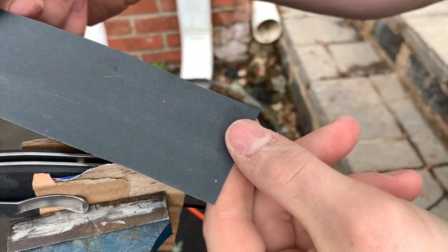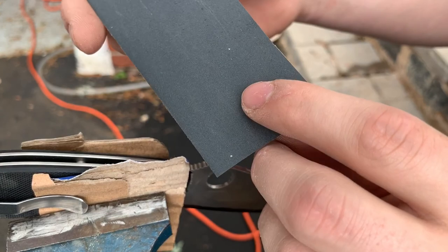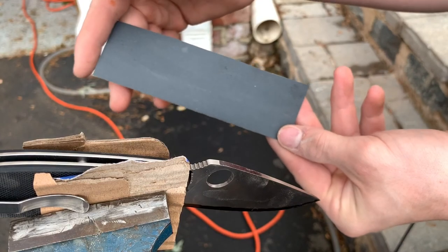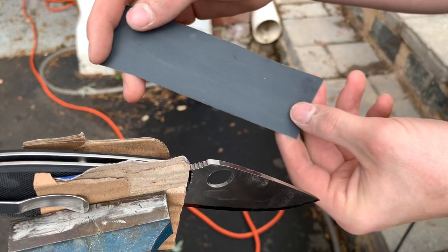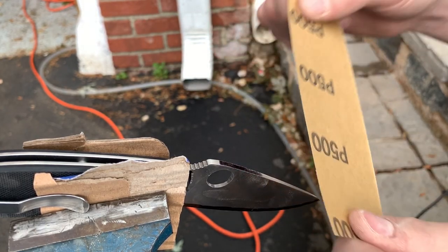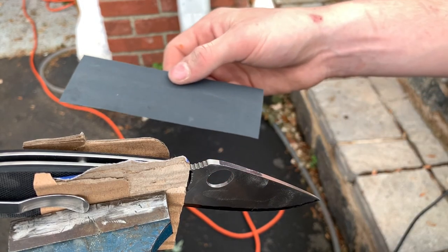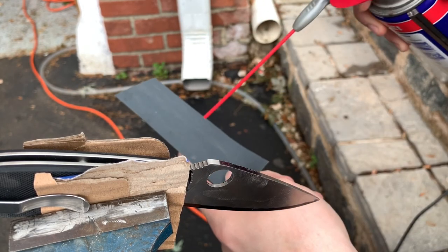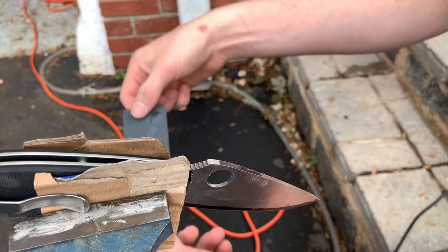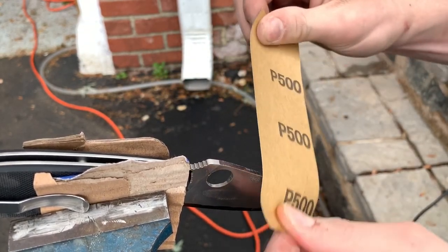So the first thing you're going to want to do when you are rounding the spine of your knife is just take a small rat tail file just to knock off the edge, or you're going to lose a lot of that sandpaper and you're going to end up going through it very fast. So I'm just going to carefully knock down the edge. You're not actually going to be doing much with the file — you're just taking off that sharp edge so the sandpaper can do its work. Next, I'm going to take some 500 grit sandpaper. If you go any lower, you're just going to kind of rub that sandpaper right off of the paper, which you do want to avoid. So I'm just going to take some 500 grit sandpaper, cut it into like a 4 or 5, 6 inch length just so that you have a little bit of room. That way you can kind of do like a stropping on the back of the spine in some different angles. Take some WD-40 or whatever lubricant you want on your sandpaper, spray some of that on there. Don't be shy — you can put a little bit on there. And then you're just going to start sanding it down.